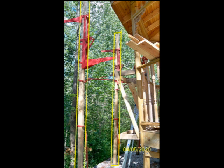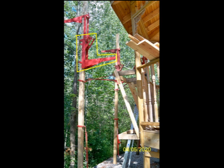Here's 2 sets. Each set uses 2 14-foot 2x4s. This is the heart of the system. The pump jack has a pumping mechanism that allows a worker to use his foot to pump the jack up to the desired height. Do a search on Qualcraft on YouTube to see videos of how the system works.